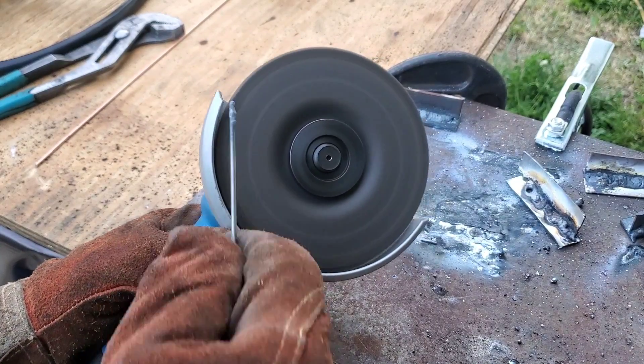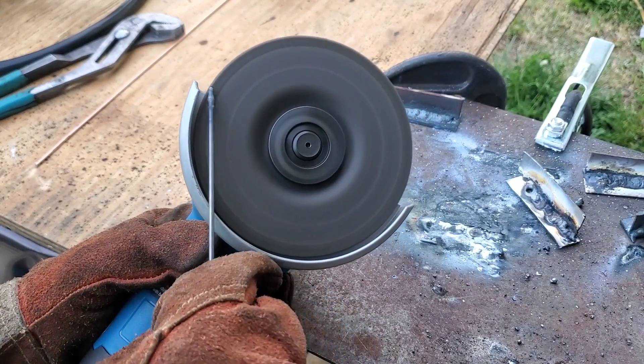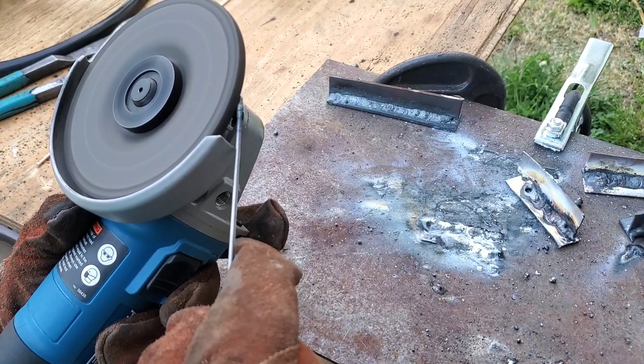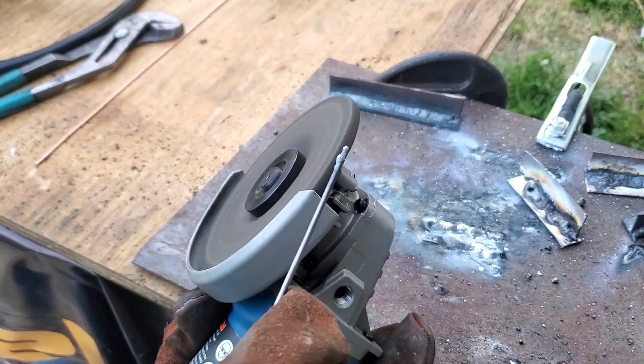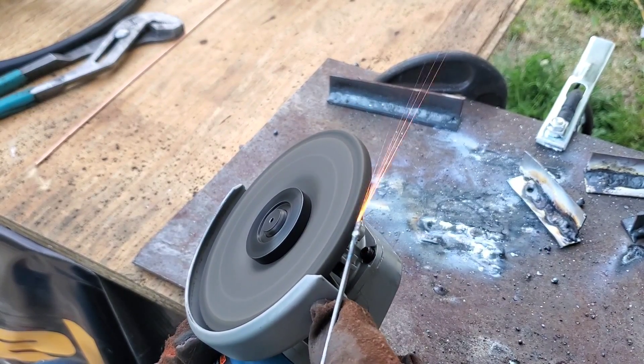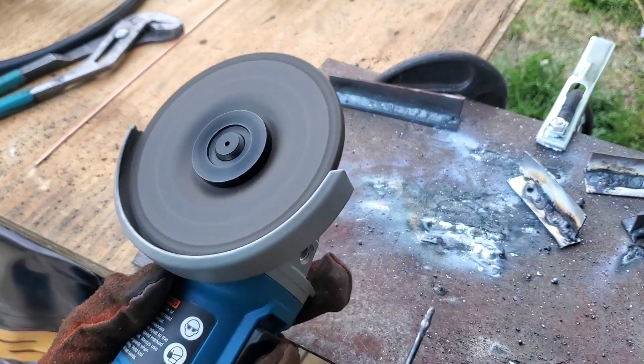You don't want to do it on the flat face because it leaves a curved profile in your grind. You don't want to do it on this edge because it pulls away and it'll leave a burr on the tip of your grind. And also it's very hard to hold on — even if you try to steady it with your finger right up by, it just wants to fall right off the edge of the wheel.